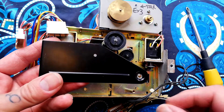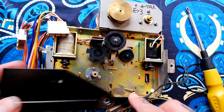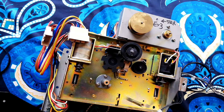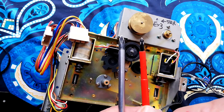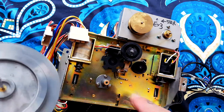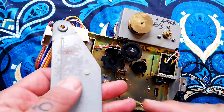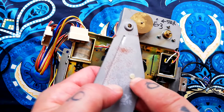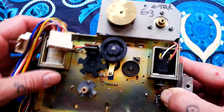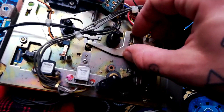With the thrust plate removed, there's a larger narrow-ferrule screw going into the post and a smaller one at the side, so I'm using a larger and smaller Phillips head screwdriver respectively. Having pulled out the flywheel — there don't appear to be any washers or mechanism on the far side of the capstan; it's just held in place by a small plastic thrust piece pushing onto the pin — that gives a bit more access to the solenoids.